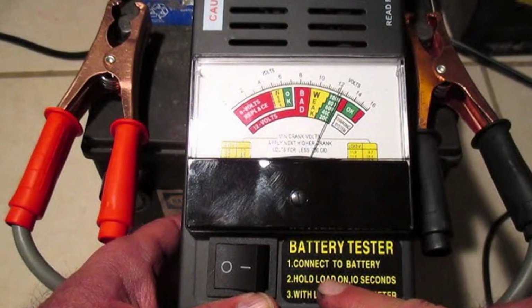Also, it won't hurt to check the battery voltage. Even though the lights are up on the dash of your loader and the engine may even be cranking, this doesn't mean that the battery is completely healthy. If it drops its voltage too low at the moment when you're trying to start your Bobcat, this may lead to glitches in the ECU, and the M6604 code is one of the natural errors you will see in this scenario. So the battery voltage shouldn't drop lower than about 10.5 volts when you are cranking the engine. Alternatively, you may use a load tester to check it easily.